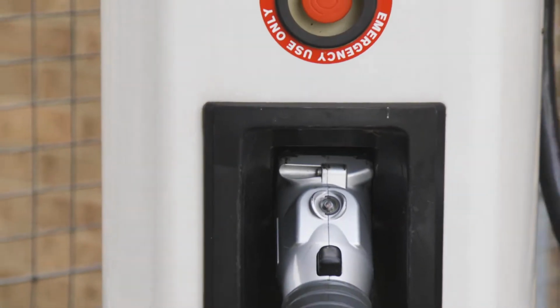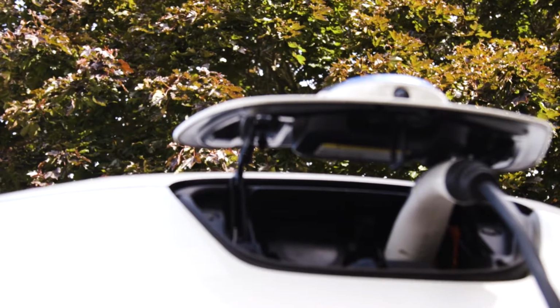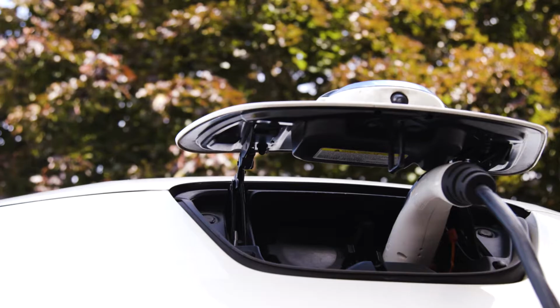Damage to charging equipment. Home one, it used to be people leaving leads just hanging in the rain. They used to think it was all waterproof. When you say, look, the unit's waterproof, but the end of the gun is not waterproof when you pour water into it. We've seen it more where you get there and you pour water out, and they still look at you like, what's wrong? So for people who have got tethered cables, units with cables attached, we always say, look, dress them correctly around the unit or make sure there's a cover on them as well. That's normally the classic one.